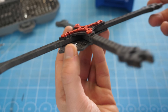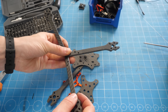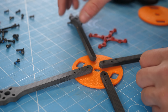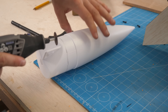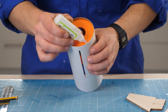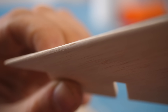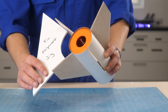It was time to radically modify the aircraft to make it much more streamlined, so we could attempt to beat our target of getting it over 100 miles an hour using the rocket booster. I decided the simplest idea would be to build an aerodynamic shell around the frame using model rocket parts. I reassembled the drone frame with new 3D printed plates before reinstalling all the electronics. The next step was to modify the model rocket components — removing the base of the plastic nose cone and cutting the fuselage tube in half so it could slot either side of the drone core. I could then glue in the centering rings for the rocket engine, and prepare the four balsa wood fins, which were delicately sanded into shape with curved leading and trailing edges to reduce drag. These fins were carefully aligned and securely glued to the lower fuselage tube to make up the fin can.